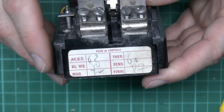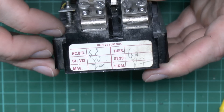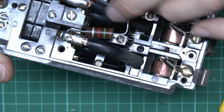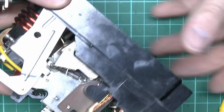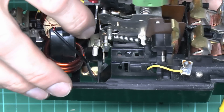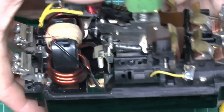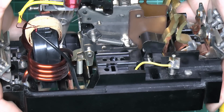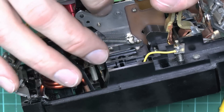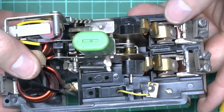There's a test label from the French manufacturer with numbers about when it was made and who checked it. There are various screws in the bottom — some probably related to testing or setting tension on the trip mechanism. One screw seems to hold the bar in place, likely used during manufacture to get the device to latch and release in the correct way.